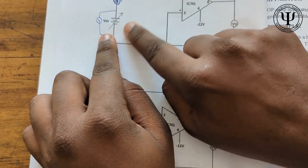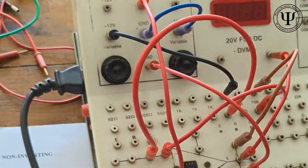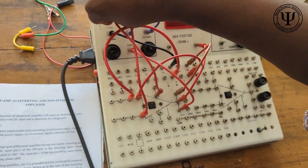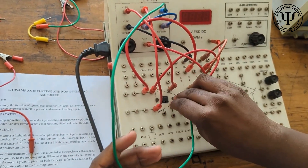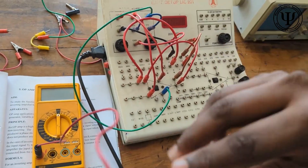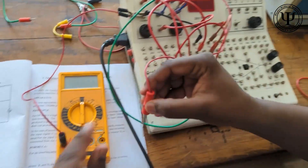We can see there is an arrow over here, so this means this is a variable. From the variable, the negative of the variable will be connected back to the ground. The circuit is complete, but without giving the source the op-amp won't work. So you have to connect pin 7 to plus 12V, and connect minus 12V to pin 4. To read the input voltage, we need a multimeter — connect the positive end to the positive end and the negative end to the negative, that is from negative of the variable to negative of the multimeter. Keep it in DC.